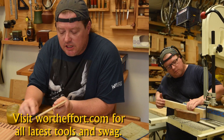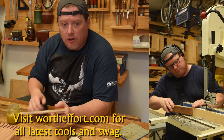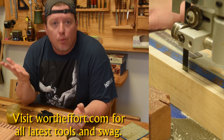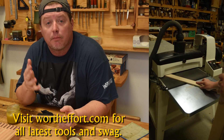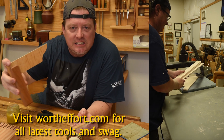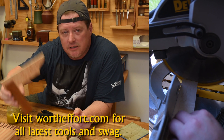With the French square, you've seen me make it, and I've been using that same one I did in the video — it's right here — for about four years now. Even as much as I've tuned it up, I show you almost every single project I pull it out, I check it to make sure it's 90 degrees and show you how to readjust it. That's the advantage of these wooden tools: you can adjust them really quickly to bring them back into true, in case you drop it, scratch it, or knife into it. They are disposable, but look at how much life I have on it. That distance above the handle is all the life still left in this tool — I barely touched it. I don't really see why, even in daily use, this couldn't last me 10 or 20 years.